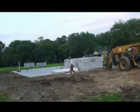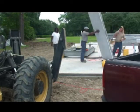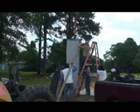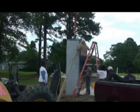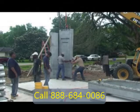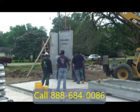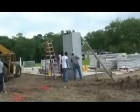Here we're erecting our very first panel — it's going to form a corner. Two panels come together to make a formed corner. You've got no problem standing it up. The brace I'm putting on right there will come off once the other piece of the corner is installed. From there on out, we didn't need another brace. Along a 65-foot long wall, I think we put two braces on there. But the strength of these panels, once they're up and screwed together, is formidable.